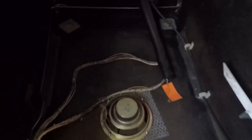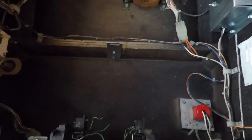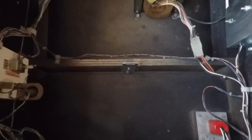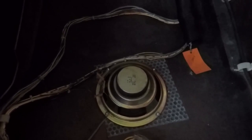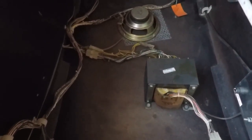I've given the cabinet a bit of a clean. From the last video the cabinet inside was filthy — really, really dirty from being sat for a long time. The lockdown bar receiver was pretty manky too. I took it to pieces and used the Dremel with sanding wheels to get all the major crud off. It's not absolutely perfect but it's a damn sight better than it was. Then with baby wipes I went through and cleaned all the insides of the cabinet on both sides, mainly the base — hoovered it, picked out bits of metal and screws, and gave it a wipe down. It was like a thick layer of dust and filth before.